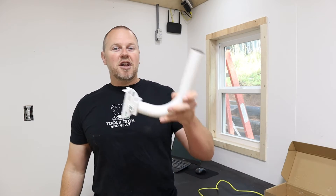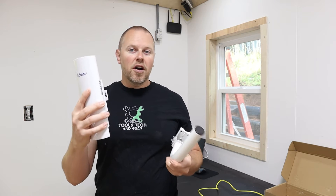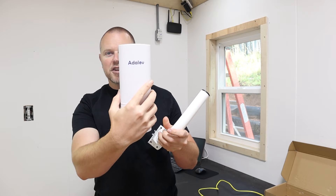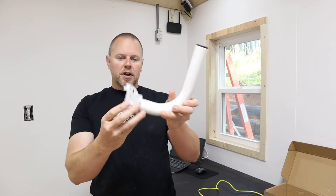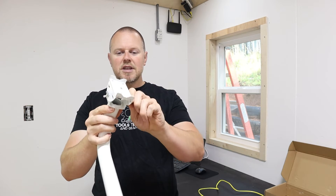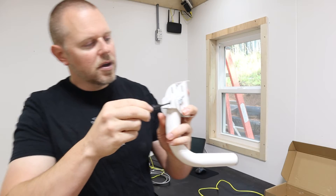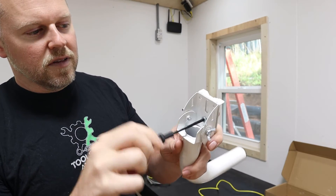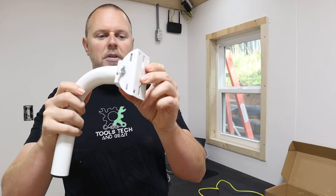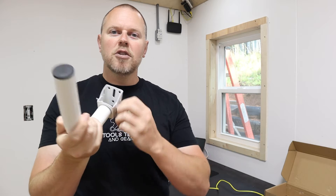On my other building, I'm going to be installing one of the bent poles because I need to turn the wireless bridge to face the other one. These bridges are directional, so I want to have at least a line of sight and also have them facing each other from the front. With this bent pole, I don't need the fence-post attachment plate, so I'm going to loosen that up, turn it to the side, and use a Phillips head to undo the screw inside so I can take that plate all the way off. That will allow me to attach this directly to the side of a building.